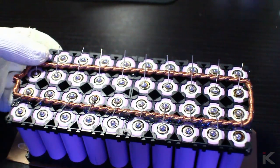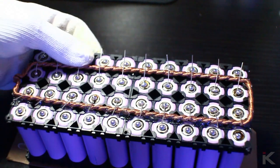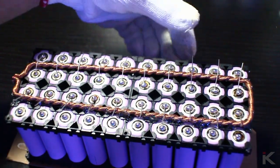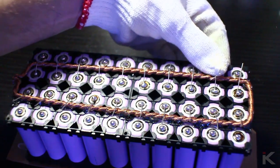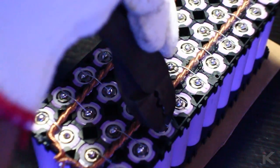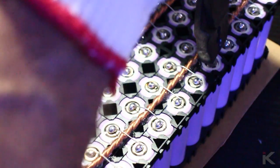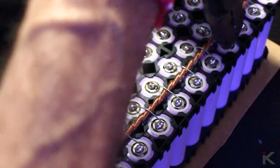When all 20 fuse wires have been soldered down, I bend each one down and make sure the fuse wire makes a solid connection with the bus bar. Once all of the fuse wire is in place, I snip off all extra fuse wire with wire cutters. It is important to do this now rather than when everything is soldered down, which will be harder to cut.